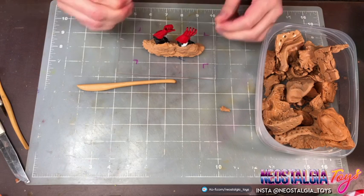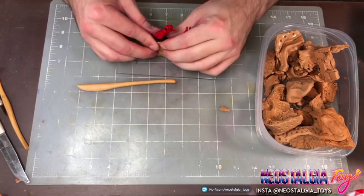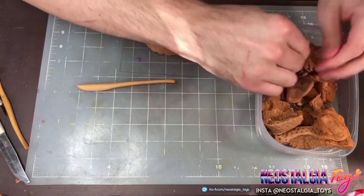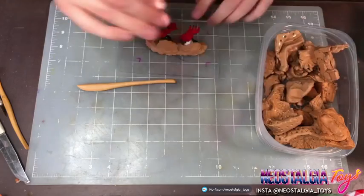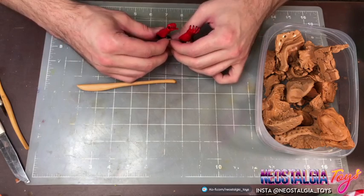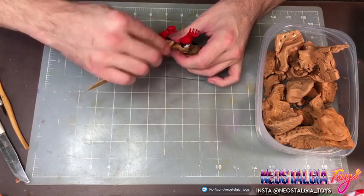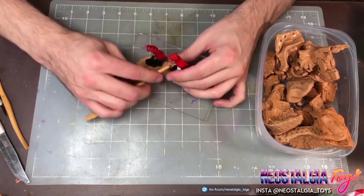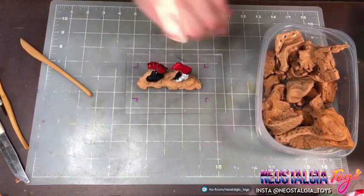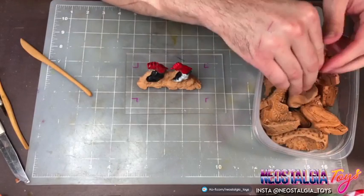It allows me to build the mold faster and then just focus on the areas that are important to the mold, like the detail I want to capture, rather than just bulking it up just because. I can pull stuff out of the parts bin or the scrap bin to use as filler and then just pack clay around that, which saves me a lot of time.